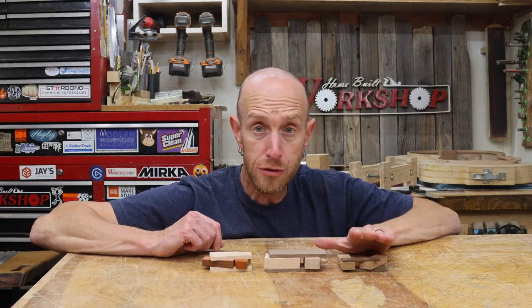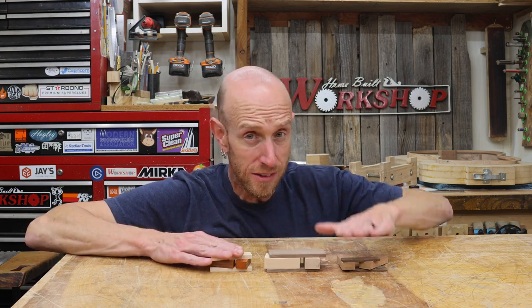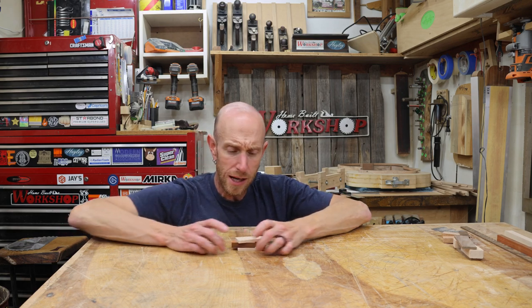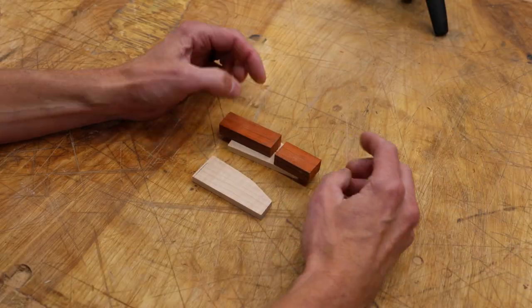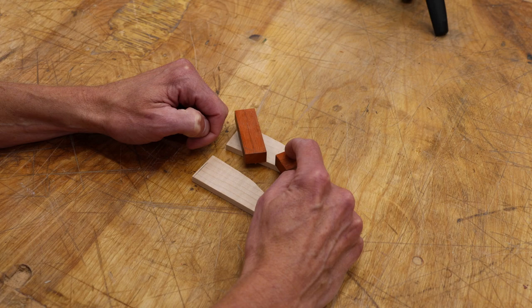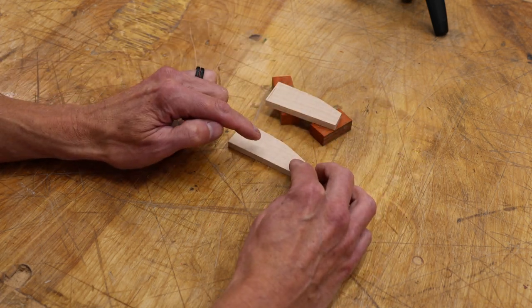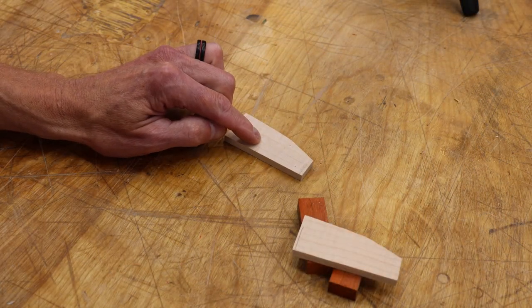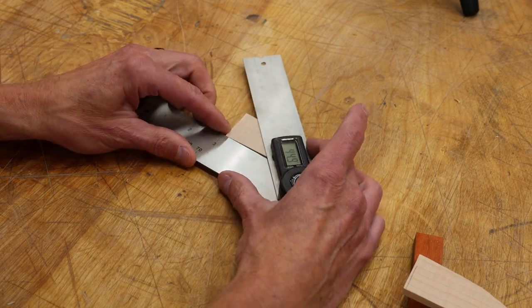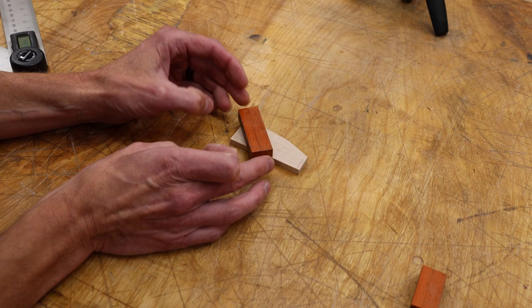Here are the starting blocks for my three planes. The construction technique will be exactly the same for all three — the only thing I'm changing is the bed angle. To keep the video a little shorter, I'll work on the other two off camera. You and I are going to work on this one made out of purpleheart and maple. For this plane I'm going to do a 45-degree bed angle. I've got one of these little digital protractors — and I'm marking a 44.9-degree angle, which is close enough.